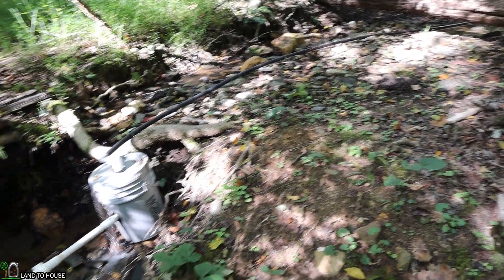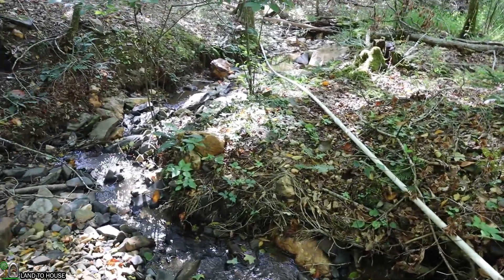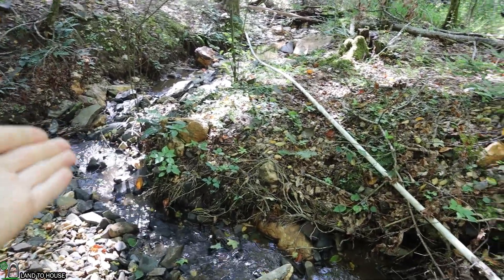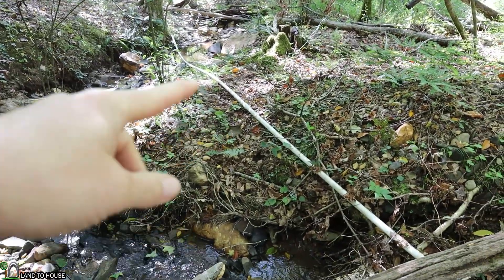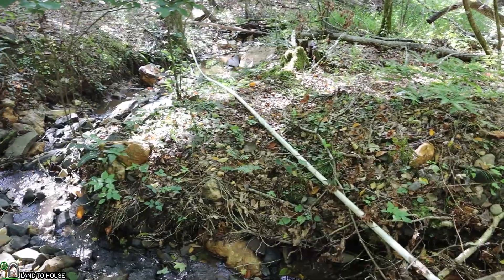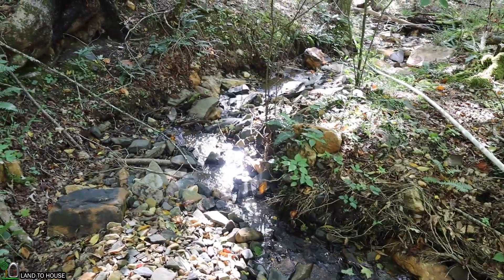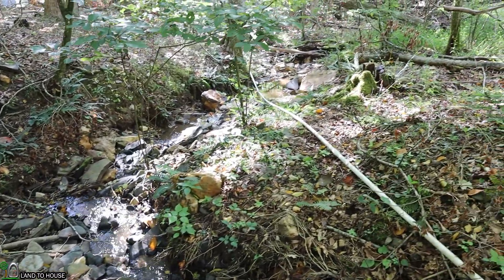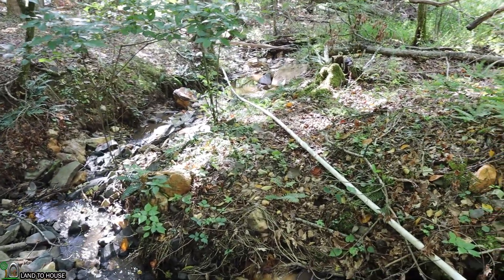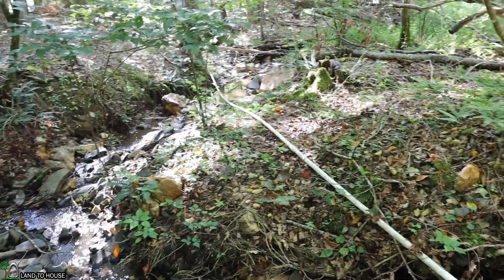Just like the supply pipe, the drive pipe does not have to be in the water for the ram pump to operate. You can see my water is over here on this side but my drive pipe goes right over here. That also helps to reduce the amount of curves, bends, and twists in my pipe — so instead of having to go left I can just go straight onto the ram pump. That right there is another good way of preventing floodwaters from washing out your pump.